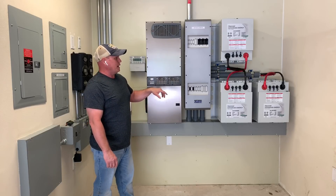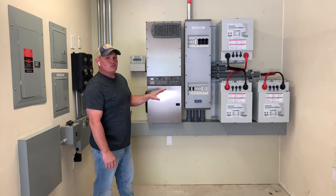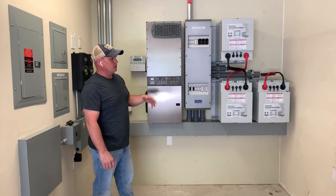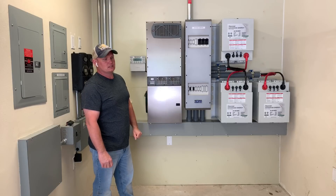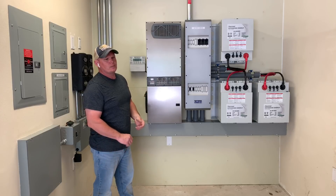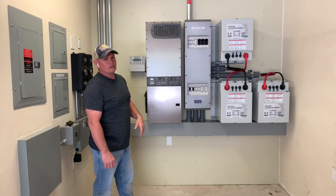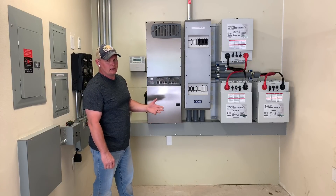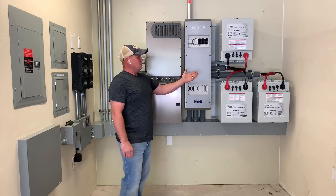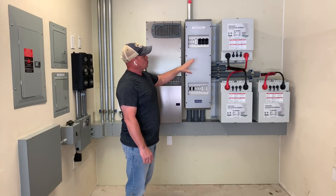So far working with these batteries and the integrated BMS has been very reliable. We have a lot of safety features — I'm able to monitor the battery and the system from home. We have a lot of controls running with these systems that we don't have with lead acid batteries. We're hoping that by having that ability, we can also catch errors — if we're not charging them all the way or if a bad cell is in there, we can see that data ahead of time and cut it off before we have any damage.